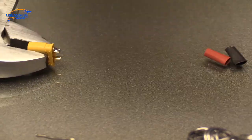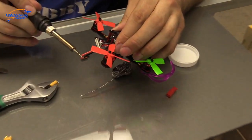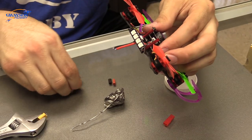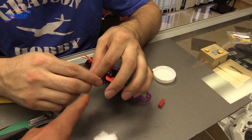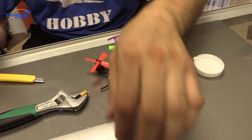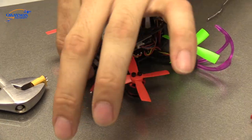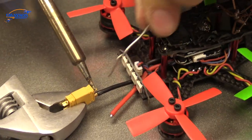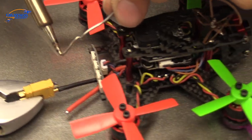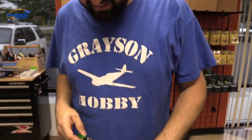There's a plus and minus, so make sure you don't mix them up. Now flowing a little solder onto that to get it tinned — that's side number two soldered. Put the shrink tube on first — I can't tell you how many times I've soldered connectors on and forgot the shrink tube. Push it up as far as it goes so it doesn't fall off. The heat sometimes melts it to the wire too. These wires are so small — if you're holding heat to them for a very long time you probably have too low a wattage iron. I'd also take the props off if you're not the best at soldering, so you don't melt them.